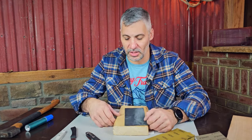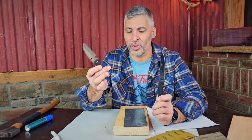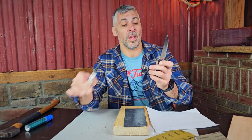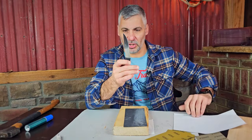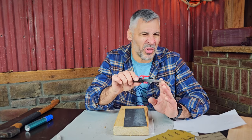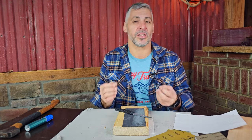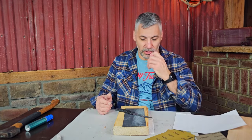Why 400? Because the blades I'm going to demo with are in decent shape — they're dull. I'm going to start with a cheap kitchen knife; you should too. Don't grab your expensive everyday carry knife like my Spyderco. I've got a really nice Cutco here but it's really dull, and a couple-dollar Chinese-made blade. What are we doing? We are grinding a bevel back into the blade in a manner that doesn't curve it over. If you use a grinder or something high speed, you tend to overheat the metal pretty easily, which can affect the steel properties. This system is super basic and you're not going to create a heat or friction issue.